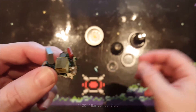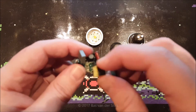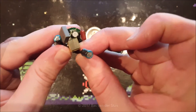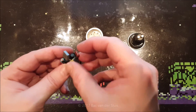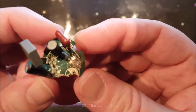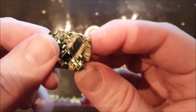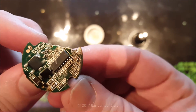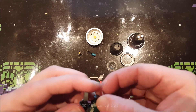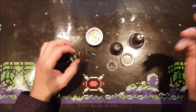By the look of this printed circuit board, it's all brown. The tiny transformer was over here and it's all broken — I had to use a fair amount of force to get it out. This capacitor was over here, and the capacitors were all spaced out of the circuit board. The board is all brownish; my guess is it overheated and just wasn't able to lose the heat from the power supply and the LED.